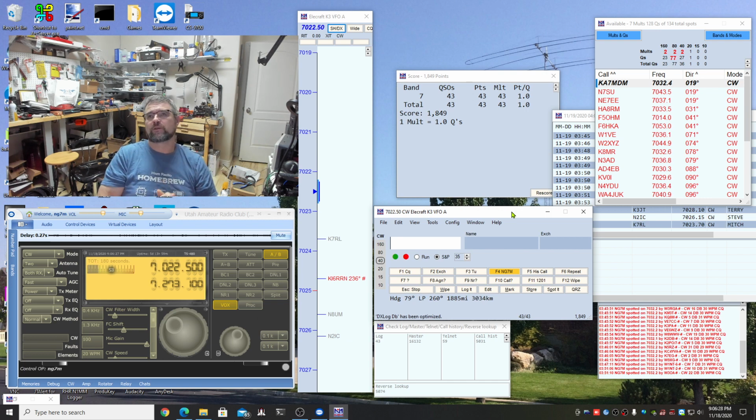That's a big difference between those digital modes. The FT modes are great and interesting, but to me, it's kind of a leapfrog into some of these other modes where you actually get to turn the dials or virtually turn the dials and learn how to operate a radio a little differently. You're dealing with QRM, other stations that are close by, and depending on how sensitive your receiver is or what its dynamic blocking numbers are, you have to pick out those stations with other stations close to you in contest environment. So a lot of fun.